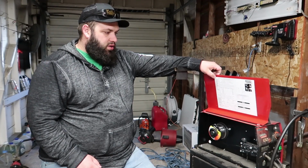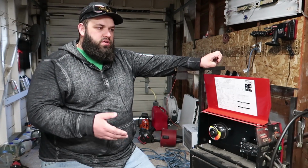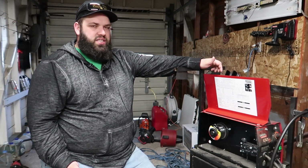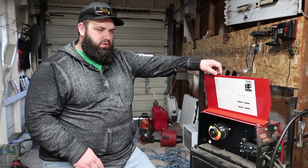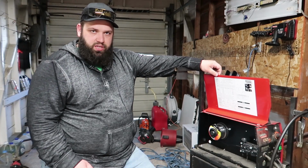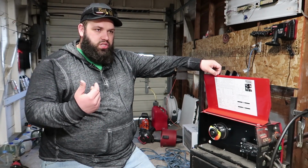But if you're just a home jobber, like me, you'll probably never build anything where you need more than an 1/8 inch thick piece of material. If you go up to 3/16, I wouldn't worry about it. If you're gonna weld 3/16, go for it. Just put a little bevel or chamfer on it, and go to town. It'll hold. It won't be a huge deal. You won't get fantastic penetration like you would want, but it'll be such a minute difference you won't even notice.